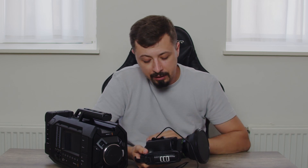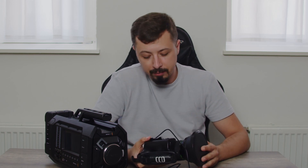Also, what I did with this lens beyond the zoom control: when I got it, it was full of fungus, so I had to open up the entire lens and clean it internally. All of the glass elements except one — which was glued together and I was unable to clean — are done. So it's almost perfect, not perfect but almost.